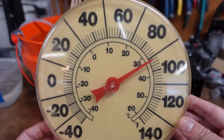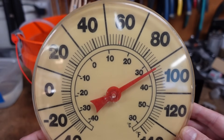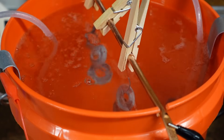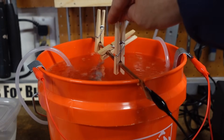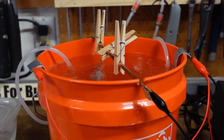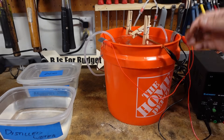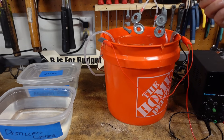This process works better at higher temperatures. I usually like to perform this at 85 degrees or higher — it's currently 91 degrees in my garage. Here's a close-up of the process: you can see the zinc beginning to plate the components by the gray finish. I've been using the clothespins to agitate the products for better coverage. It's been 20 minutes — I'm going to power off the unit, unplug it from the wall, and then disconnect the negative alligator clip from the copper tubing. It's got a nice gray finish on all the components.